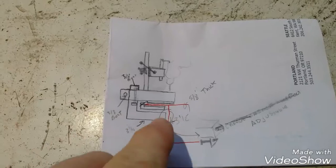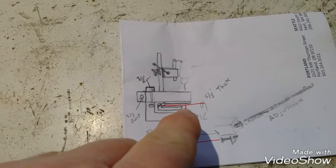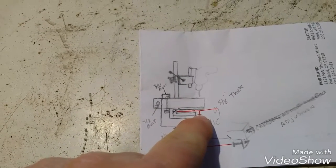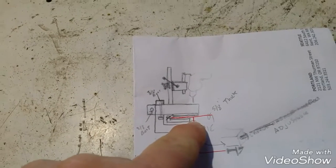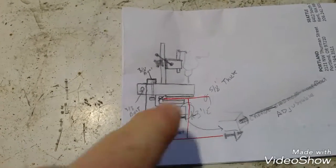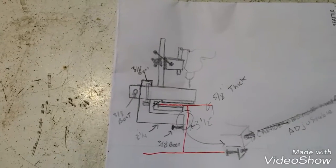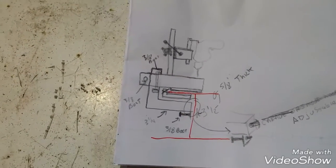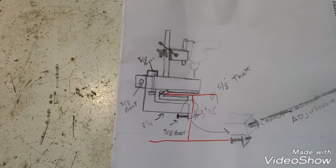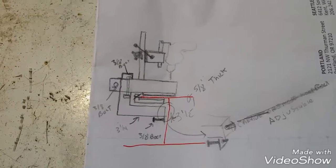We're drilling right in the center of the I-beam — about an inch into solid steel — and we have 150 of these holes to make. That's getting a little tiresome for the guys doing the work. It can take up to 10 minutes to drill a hole, then we tap it with a bottom tap and mount the clip with the stainless 10-32 screw.